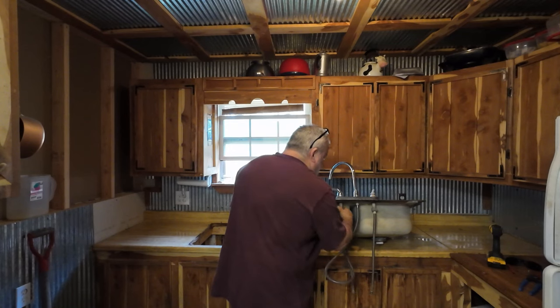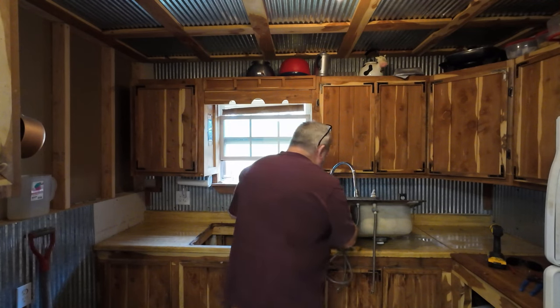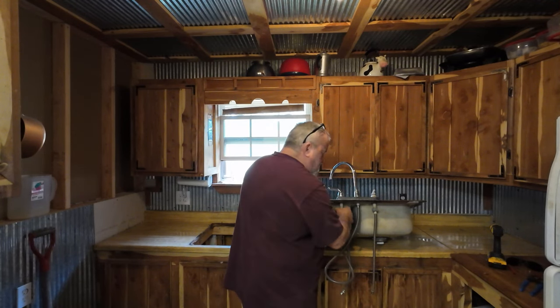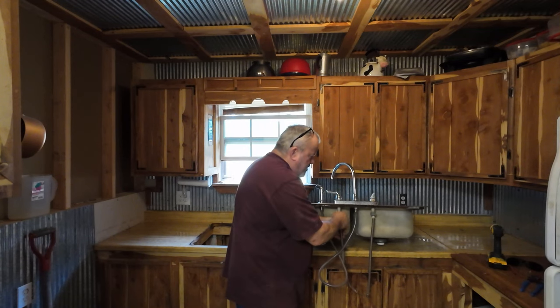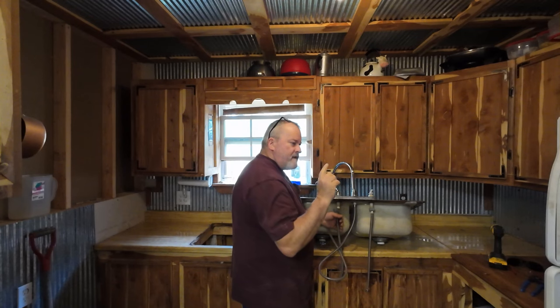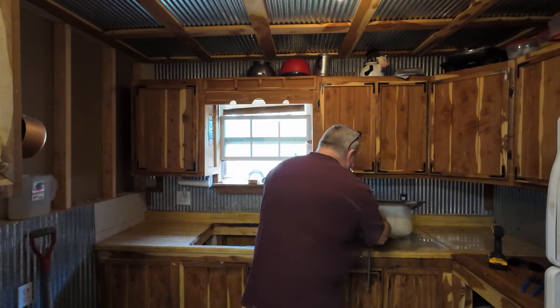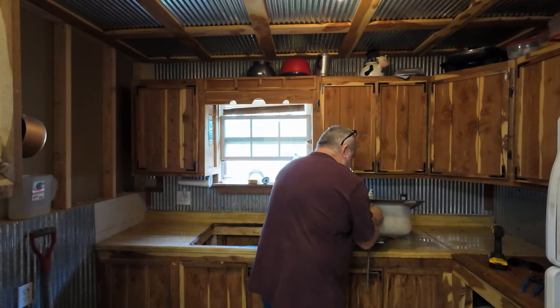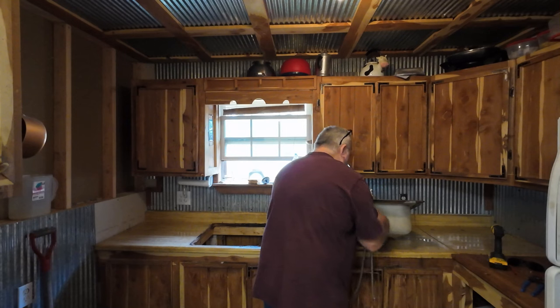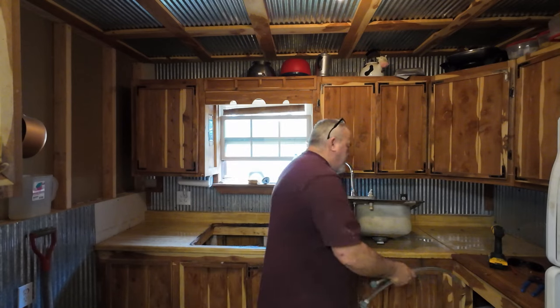These quick-connect ones are a lot better. Used to be if you wanted to replace something, that's why this is broken - I've never replaced it because there is nothing worse than getting underneath the sink. You used to have to have a special tool, kind of like a U-shaped wrench, and it took forever. But these new ones are nice - just unscrew them, and then there's another connection from the main water line that screws in with a little Teflon tape.